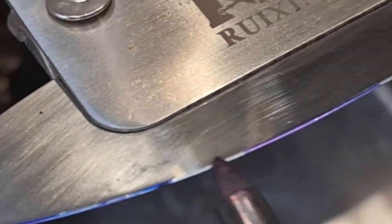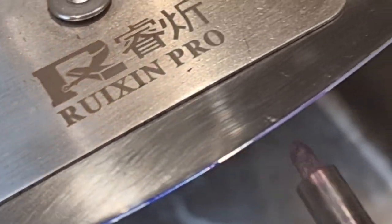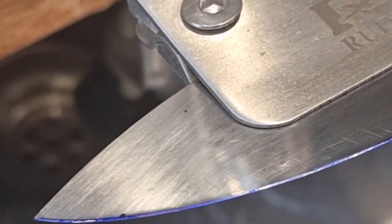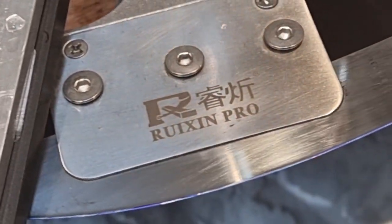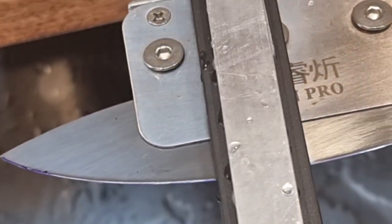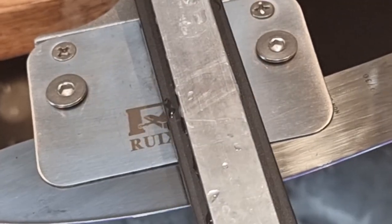The spirit-based pen is going to ensure that we get a clean sort of angle. There's a nice blue mark on there now. That's a diamond stone, not ceramic, not whetstone, diamond. Ceramic is rubbish if you're doing this sort of knife sharpening. The rotational flip system helps this here to maintain the same angle.